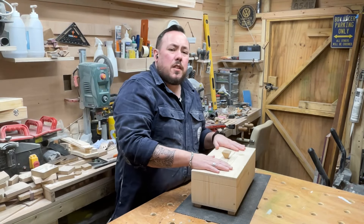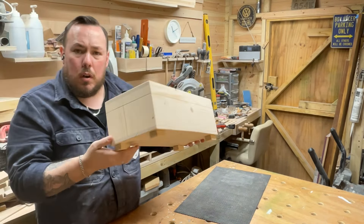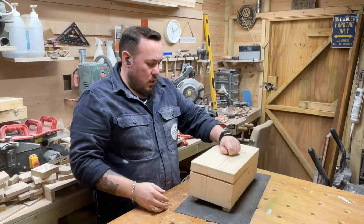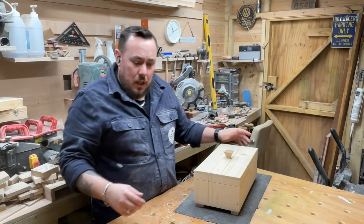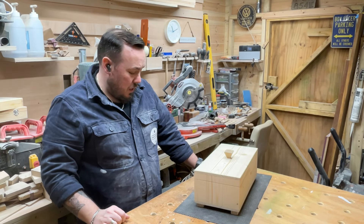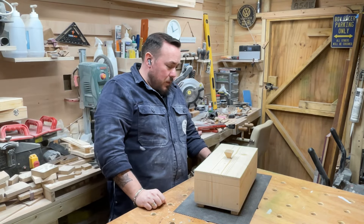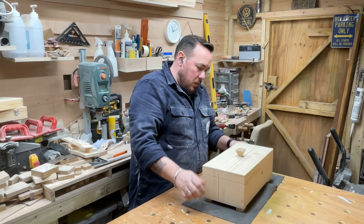The feet are on and left in just a little bit from the edges, giving it a bit of a different profile. The handle looks good and locates nicely with those inner pieces. The next step is to give it a hoover off, get rid of the dust, and then I'm going to put a dark oak stain on it. I've got the oak handle on there and I think it'll be nice to darken the pine body up slightly to complement it.